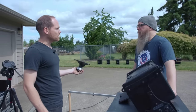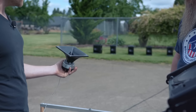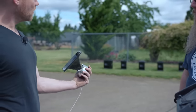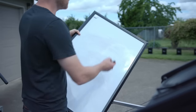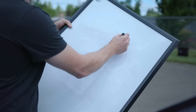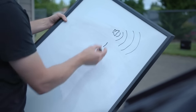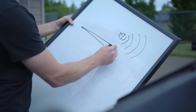For the horns for high frequency control, we have a horn like this, but it's spreading sound a bit like how a flashlight spreads light. It has some directionality to it, but we need something that's really tight like a laser beam. That first horn shoots sound very widely. So the horn we'd need to shoot sound straight forward would have to be so long that it's not going to fit inside a tiny line array box.